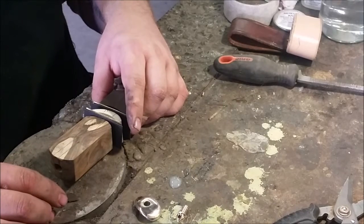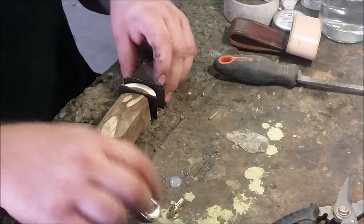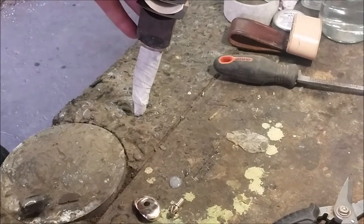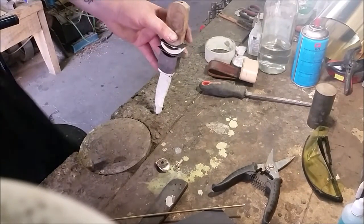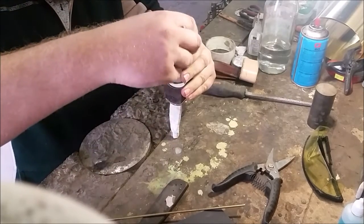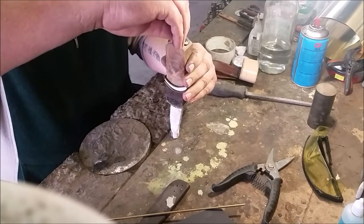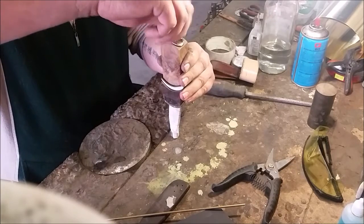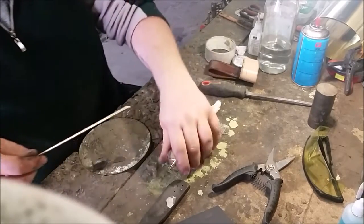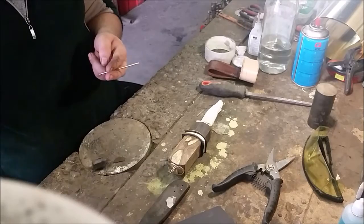You've got to force it into a bend so it all goes in. It wants to resist and push back, so be careful especially when gluing, because the nut that fastens it is sitting deeper than this might reach. When you assemble it you've got to push it all down, put the pommel on, and find the nuts. This is a 3.2mm threaded rod — I've drilled a 3.5mm hole.